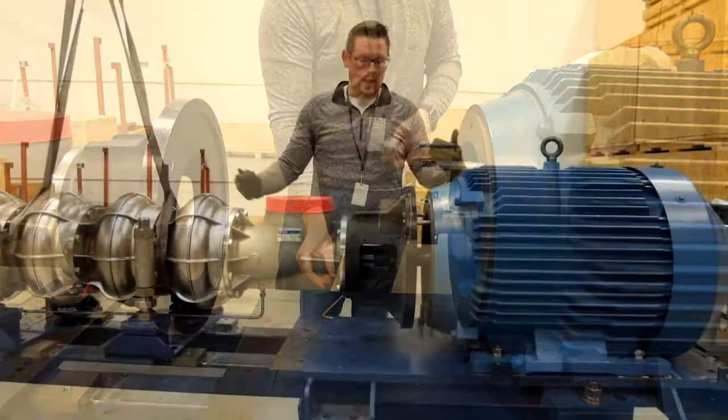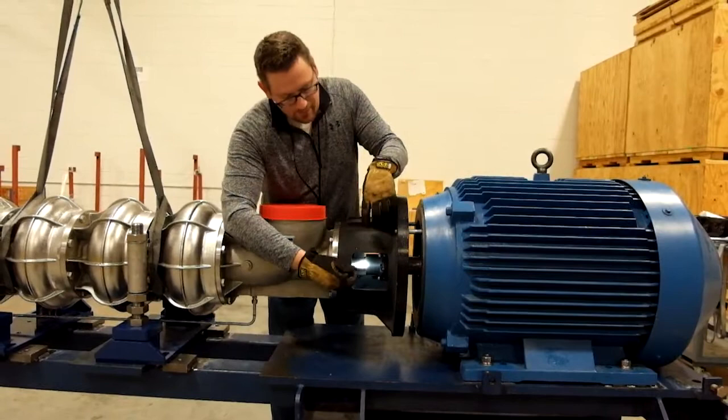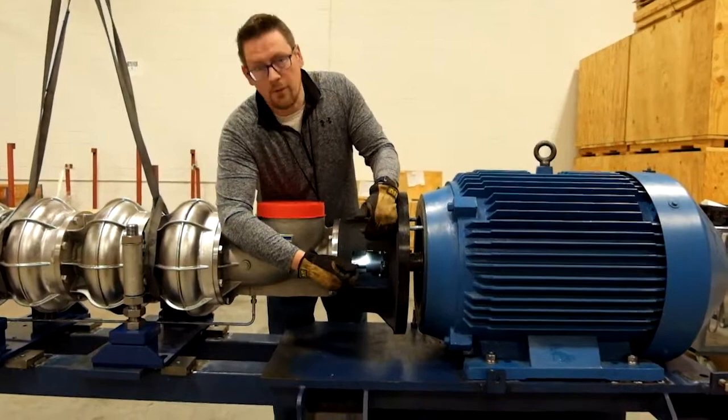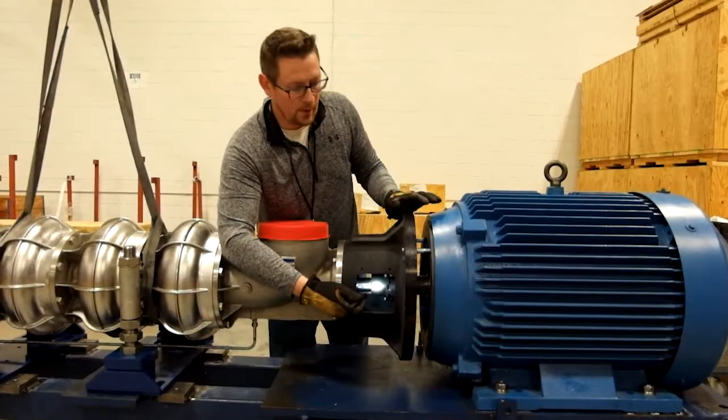With the pump sitting on our pins, the next step is to get the pump shaft to insert into the coupling. I like to have the pump shaft with the drive key viewable through the window so it's easier to line the coupling keyway up to it. I find it's easiest to visually see how it's lined up before starting to push the pump into place.